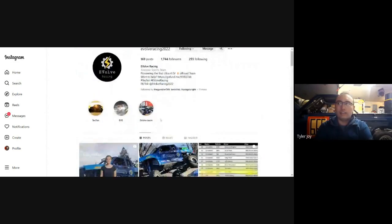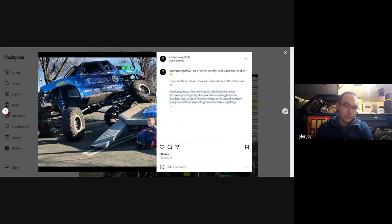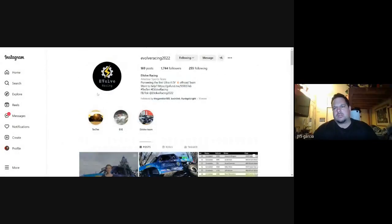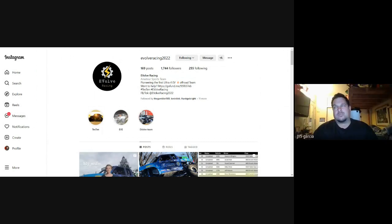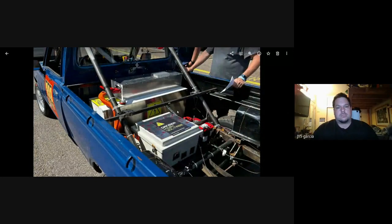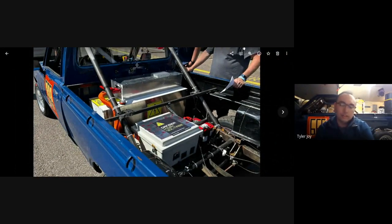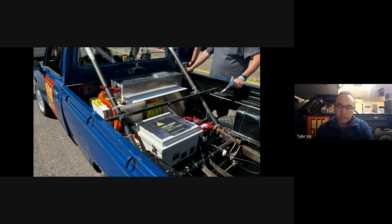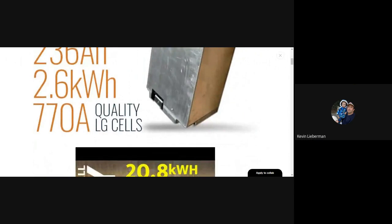Okay. We actually thought about cutting it up, but because of the rules, we have a BMS on each sub pack, so the cost gets astronomical. Right. It'd be interesting if you could. What voltage are you running, or what motor's in there? Hyper 9 HV net gain. Okay, so you're like 144 volt. Yep. 36S, but what batteries are you running? Jaguar I-Pace. Okay, I've never messed with those things. They're really, really nice from a design standpoint and build standpoint. Like we have 14 modules and we slap them in versus thousands. Okay. They're cool. 4S3P.